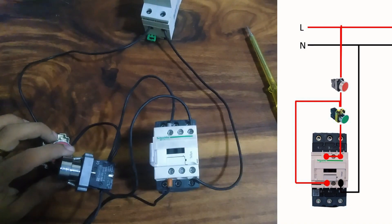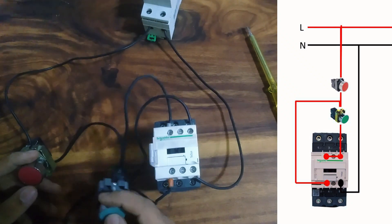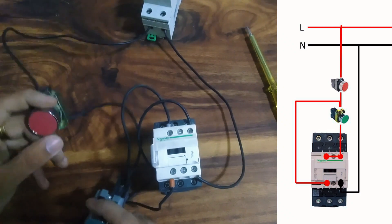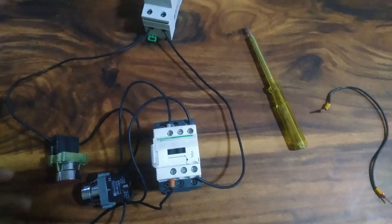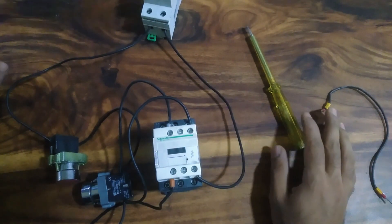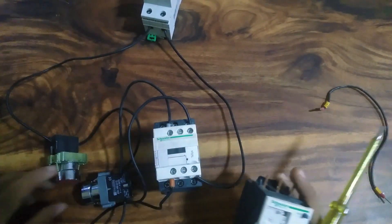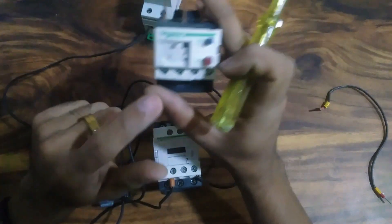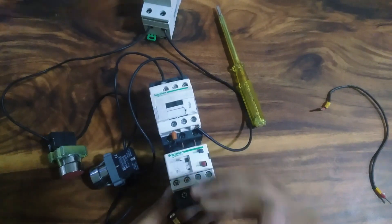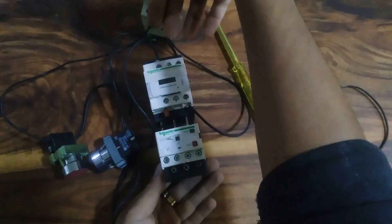Take the contactor for a moment. I have to turn on the contactor. I will press the contactor and connect it. I will turn it on and then off. I'll do it with self-holding. It's not complete yet. When you release the push button, the circuit will automatically stay on, and then you will have to load the motor and the contactor will be out. Now we have control wires and the control path.